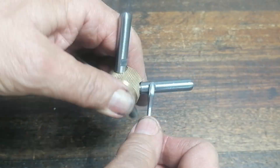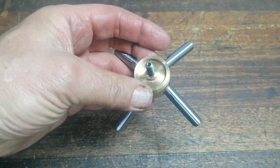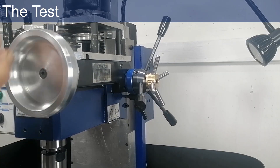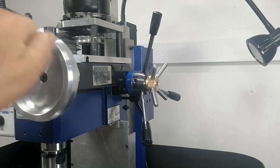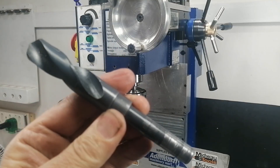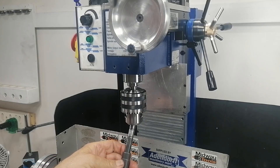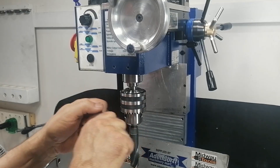Next, I milled flats on each spoke so I can tighten them with a 7mm spanner. And here's the result: four steel spokes screwed into the brass thumb wheel at a comfortable angle. Now, tightening the clutch takes almost no effort. The spokes give just enough leverage to bite down hard — no more weak tightening, no more digging around for an Allen key. Best of all, accuracy stays perfect even when drilling under heavy load. Small change, big improvement.